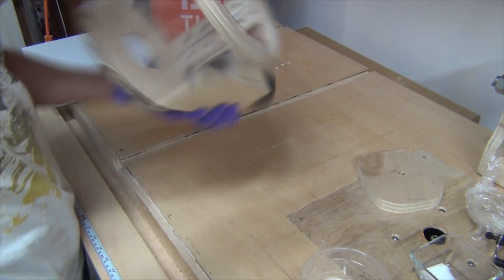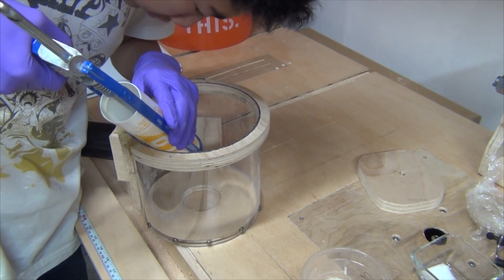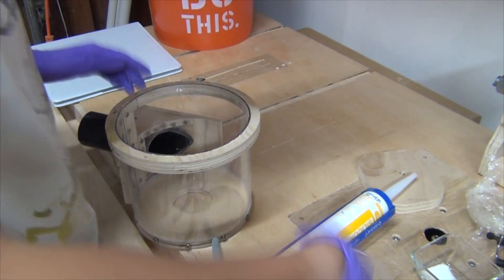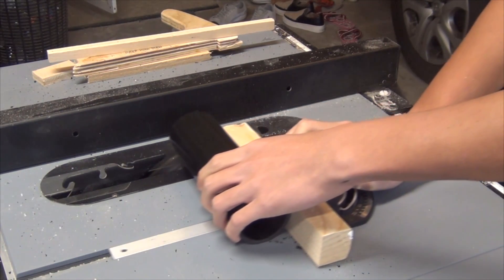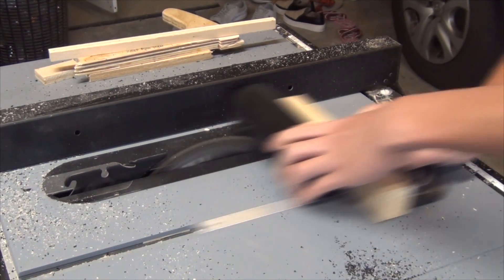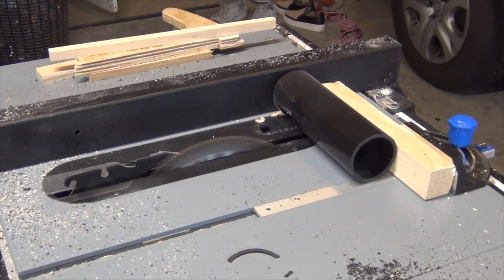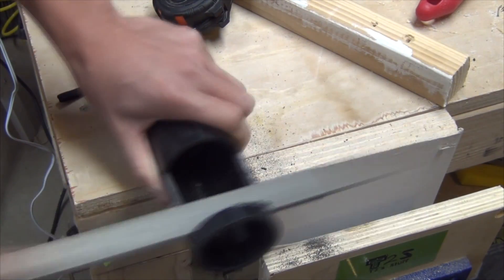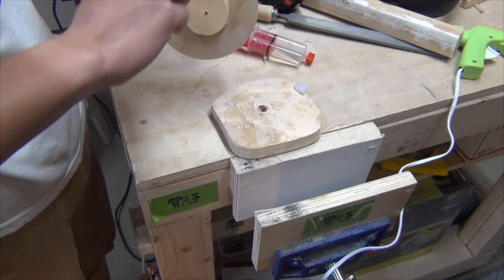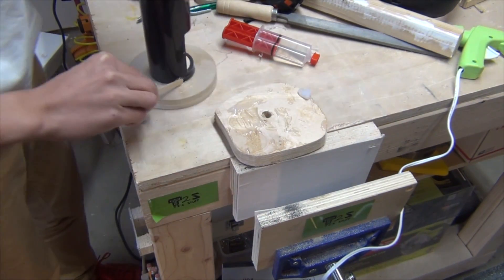Here I'm applying silicone to make the cyclone airtight. I made a mistake wearing gloves — you really should use your finger and soapy water to smooth out the silicone for a cleaner result. I then hot-glued the pipe onto a scrap piece of wood, used my miter gauge to cut a notch on the table saw with the fence as a stop, and used a file to smooth out the cuts. Then I mixed some five-minute epoxy and covered the baffle piece before attaching the pipe to it.